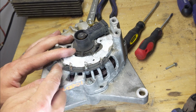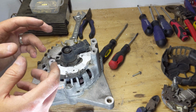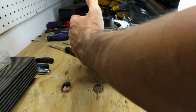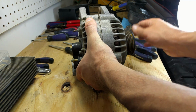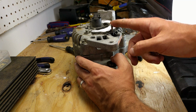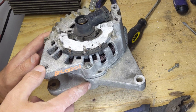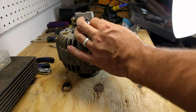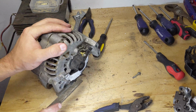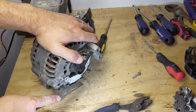And whenever you send pulses of electricity to the outer coils, that generates the repelling force to the middle part of the alternator, and it makes the alternator spin. Okay, now in this next part, I'm going to test this out to make sure that it works. I will wire up some wires to this, and I will connect this to a speed controller and see if we can get it to spin. So first things first, I need to get a file, and I'll need to file away good contacts for soldering.